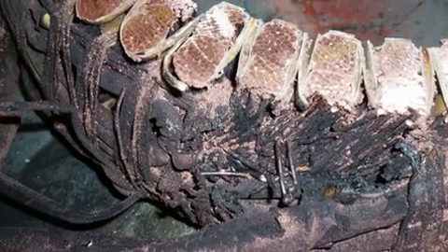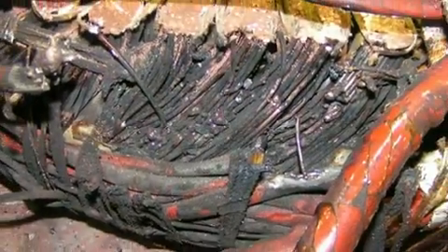The variable frequency drive is going to be looking for ground fault current at a high value — looking for a much higher level of ground fault current than would normally happen on a resistance grounded system. If a ground fault were to occur, it would likely persist and create damage as current is traveling in a path that is not intended to travel.